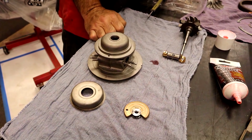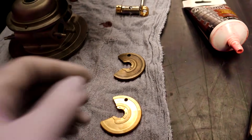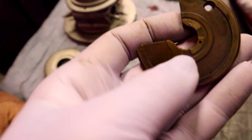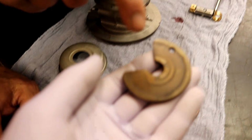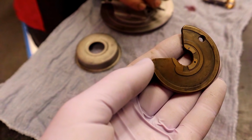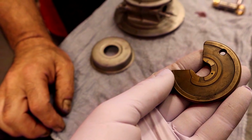Here's our old thrust plate. And there were some differences, right? If you remember, actually, wait, we found that weird little thing. Yours was clogged. One hole was clogged. Can you guys see that? It's a little bit of rod bearing. It looks a little metallic-y. Oh, God, I hope it's not a rod bearing. Well, it could have been from the last time. Or it could have been something, but there's some metallic-y. It was small enough to make its way through the whole system and ended up right there. And I also bought this off of somebody used.